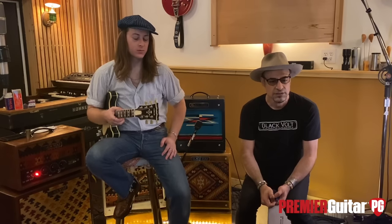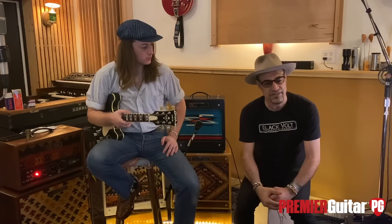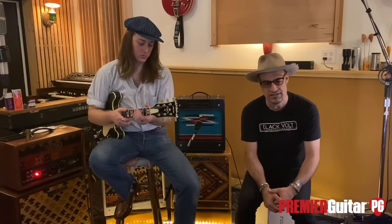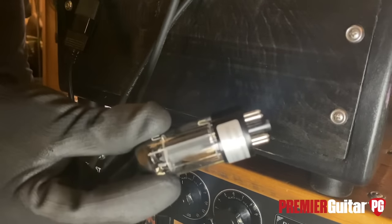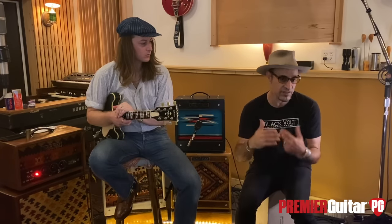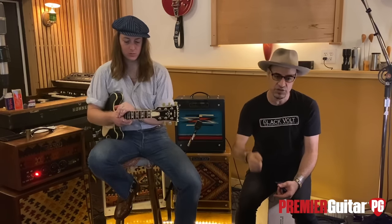And then as far as the power section, it has a Class A cathode bias, which allows you to basically use any octal-based tube socket. So you're able to put in 6V6, 6L6, KT66, 77, 88, EL34s. Because it's a single-ended power section, which means one power tube, it's always on, which is part of the Class A characteristic. So you're hearing a full change when you change a tube.